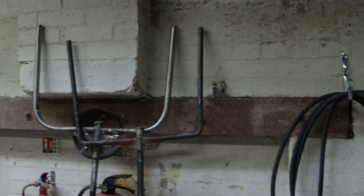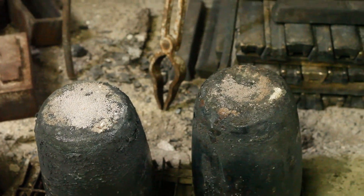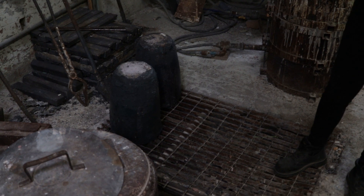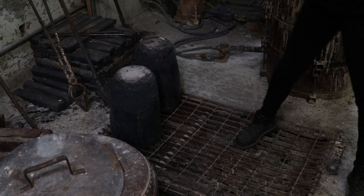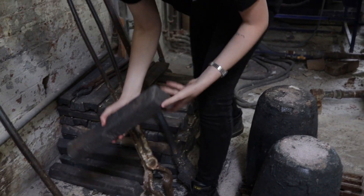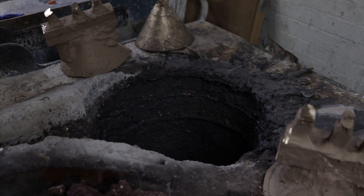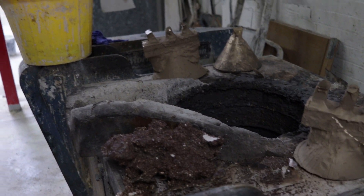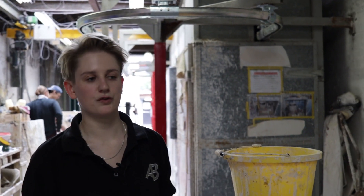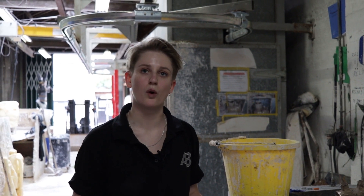These are what the crucibles are held by. The crucibles are here — whilst they're cooling off they're put upside down, just like a long soup bowl. These are our bronze ingots — this is what we melt down. If we're doing a full tank, those ingots get stacked — we want to melt as much as we can at one time. We fill the tank with bronze, which gets to about 1,100 degrees throughout the day. Our foreman of this workshop melts everything down starting from about eight or nine AM and we pour at about 3 PM, so it takes quite a long time to get up to that temperature.